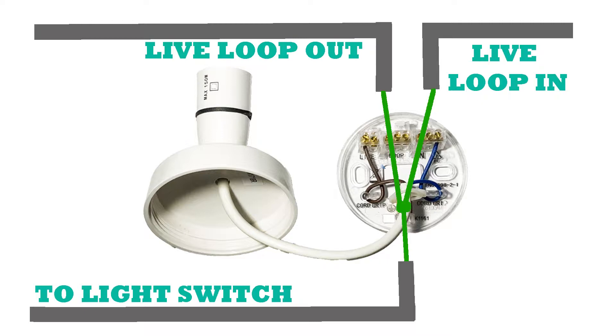For simplicity, and to keep the diagram less cluttered, I'm going to ignore the earth wire from here on in. So live in and live out — pretty much these just get joined together. The neutrals of these two cables go into the neutral block, and similarly the lives get joined together in the loop block. The switch wire straddles between the live terminal block and the loop terminal block, and the lamp itself from the ceiling rose connects to the live and to the neutral.